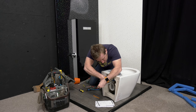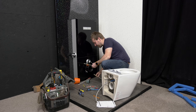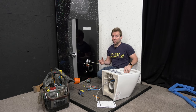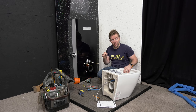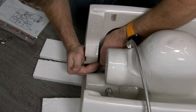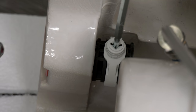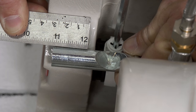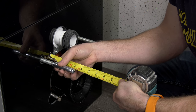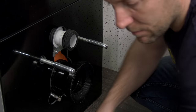Our next job is to prepare the bidet connection — just snip that off like that, and that's pretty much ready. Now we get our studs in for the toilet itself. We wanna leave about 20 millimetres out from where these actually stick out. I've shown you in previous videos the way that we measure these. Here is a brief recap: pop on the clamp and the retaining plastic piece so they hold the clamps in position on the toilet. Then insert our handy Allen keys. Once you've done that, measure from the back of the toilet to exactly where our receiver clamps go, making sure there's plenty of threads still inside the receiver clamp — at least 20 millimetres of thread. Make sure the receiver clamp dimple lines up correctly with where our Allen key is gonna be screwing in.